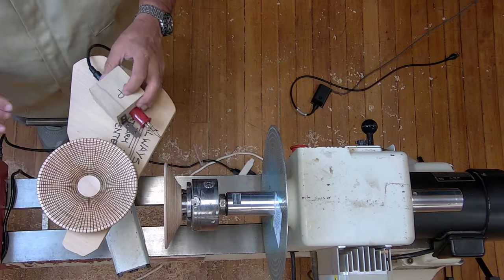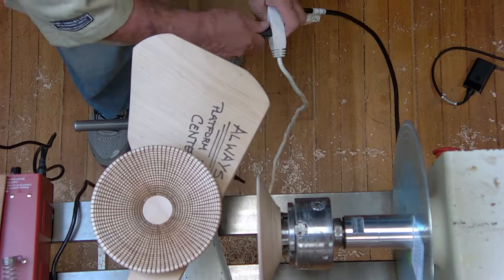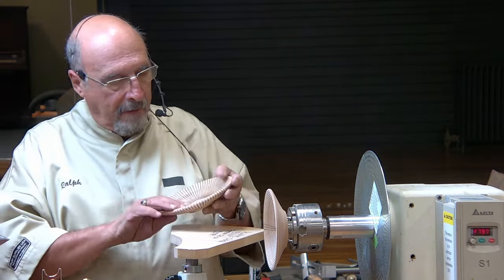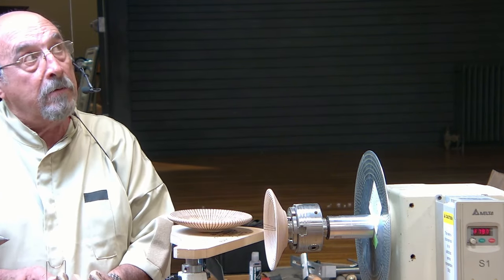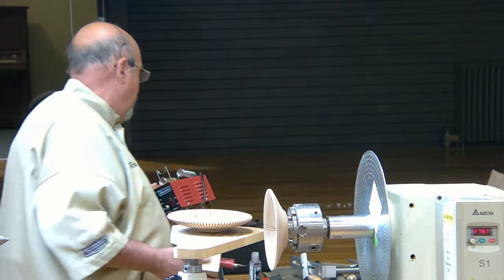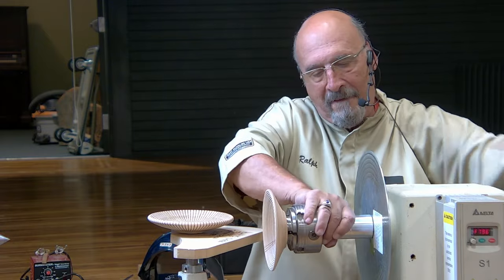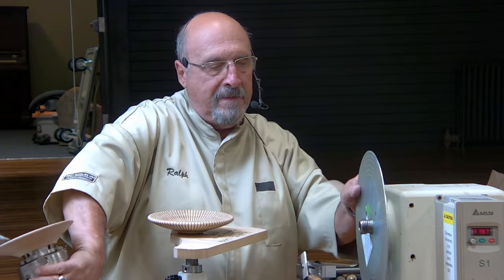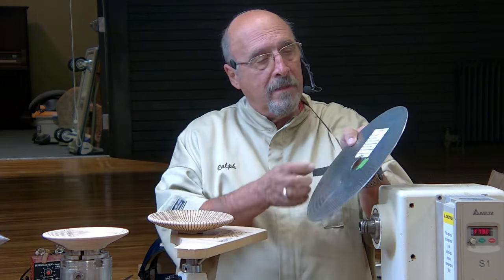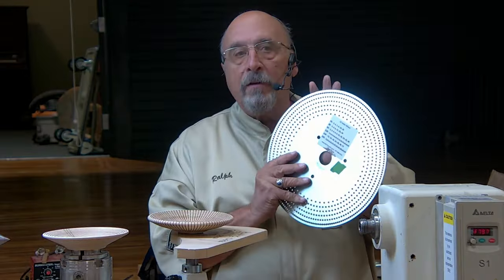So now we burned it and we're ready to do the design. Here's another tip I learned the hard way: you can't do an 88-segment piece and burn a design that takes 13 segments to repeat — 13 doesn't go into 88. Whatever you do, you've got to make sure it's divisible by your pattern. On the indexing wheel, for us math whizzes, it tells you right here — for the 88, you can go 2, 4, 8, 11, 22, 44. Those are the repetition options for your design.